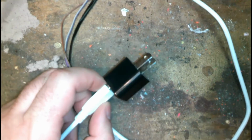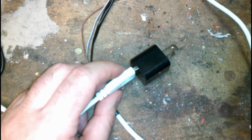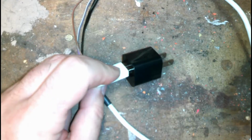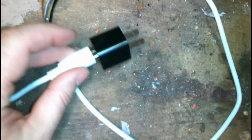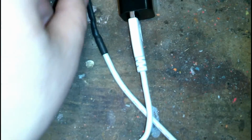So what I decided to do, based on suggestions from David ABD over in the Haunt forums, thank you very much, David, really appreciate the help, was to, like I did yesterday, try to power the relay separately. But I was doing it, first of all, with a 9-volt, and the relay boards are 5 volts. So I'm kind of glad that didn't work.